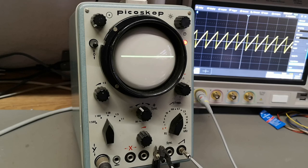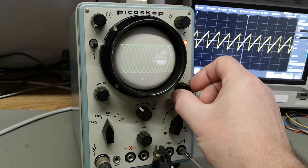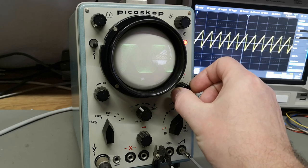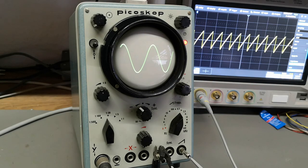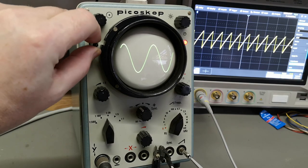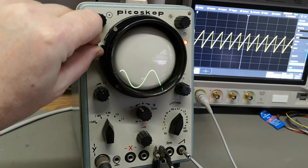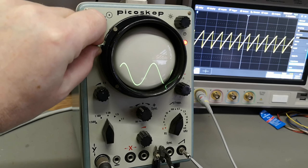Let's go again at one kilohertz. But what if I go to 1.1 kilohertz? See — there you have it. Then you need to perform a little bit of adjustment on the sweep, and here we go — there's a picture again. Note the picture gets a little bit distorted.